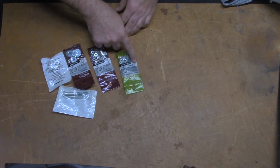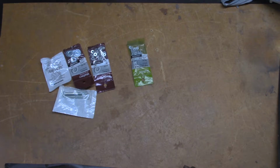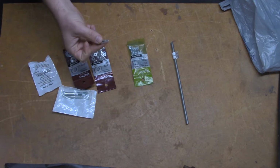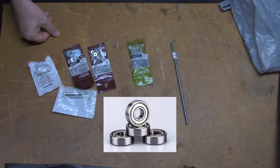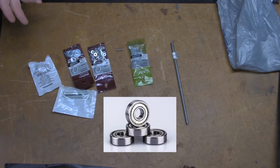And these are the number 6 machine screws by 2-inch with nuts. So we can use the second 8mm bolt, or we can use a piece of 5/16 threaded rod. Either way, I have the rod in stock, so I'm just going to use that instead of ruining the bolt. We also need Creality style springs, and you can get these on AliExpress 10 for $1, so we need 2. That's 20 cents. We also need 3 608ZZ bearings, and these are available on AliExpress for 25 to 50 cents each. So that's 75 cents for them. In total, everything here should cost 10 bucks.